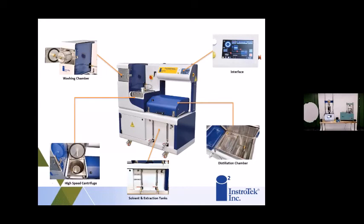And then you have your solvent extraction tanks. This system will distill the solvent again after use. So you recycle some of that solvent, not 100% of it, but you do recycle a good amount. 80 to 90% of that is recycled, and then you'll have distilled solvent to use in the system. And then at the very top, you have your distillation chamber, and it all works well together at the same time.